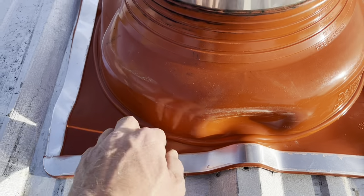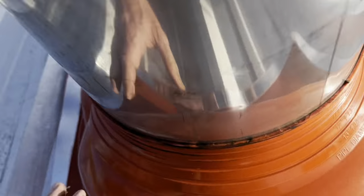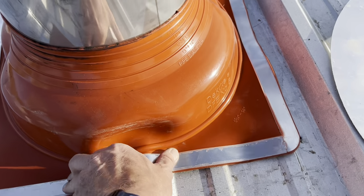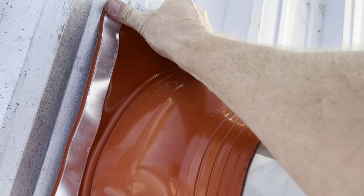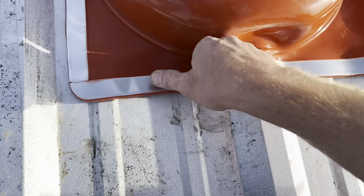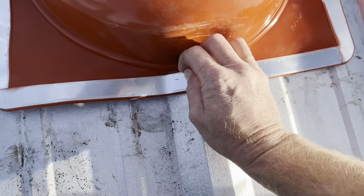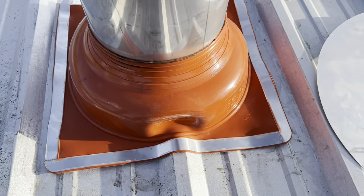You take and fold this or mold it around the ridges in your tin roof, and I'll go around to the back and do that as well. I don't need to be super exact on this yet, because what I'm going to do is take a marker and trace the whole way around here for where to put my silicone to hold this down — you want to get it about 90% where you're going. I'm going to pull it forward just enough with the pipe; there's a little flex in the pipe to cover those old screw holes so I don't have to patch them up.